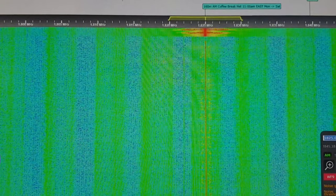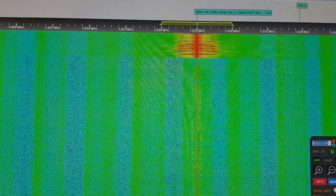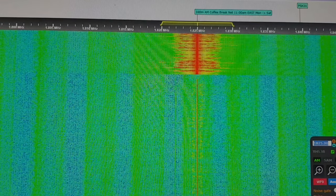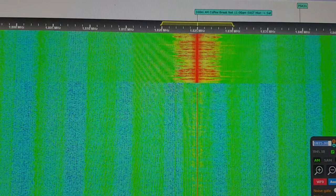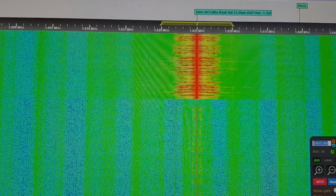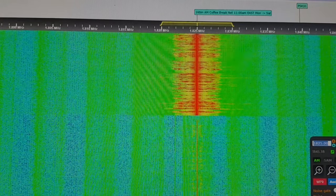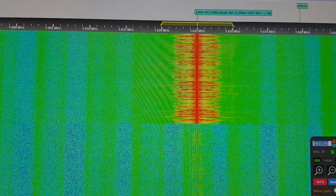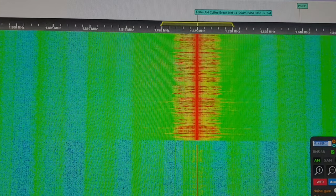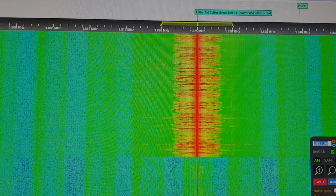Okay, Paul. I didn't comment on your transmission earlier. Well, let me say that it's robust. It's very, very good. You're peaking up to about 21 dB over 9, which is what Laurie does at the best of times. And the modulation is superb. Only one really picky minor comment, and that is the modulation is a little bit spitty, possibly something to do with your microphone or how close you are to the microphone, but that's being really, really picky. Nothing to do with your transmitter. It's going like a rocket.